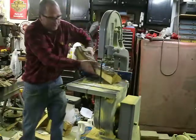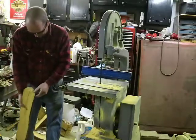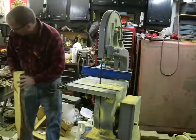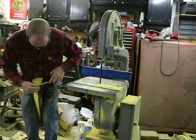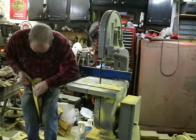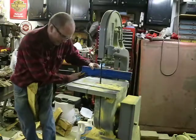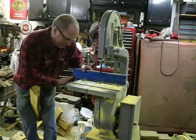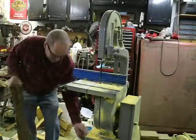Now what I do is I just take, and I see I got 2 ends different size here. Well, I want to give it a width of at least 1.5 inches. This end's not going to be a problem. This is. So I just measure over to see where I'm going to have 1.5 inches. Put a pencil mark there. Come over here, 3.5 inches. Set my rip fence at 3.5 inches. Okay. Right there. Lock it down. Now I got an edge to run against.